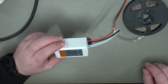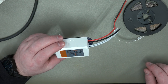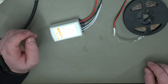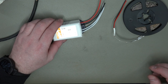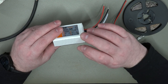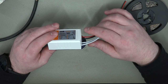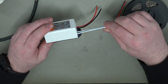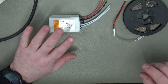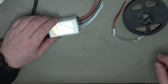We've got here our cheap little LED driver — this is an 18 watt rated one, 12 volts output, 1.5 amps, more than enough. I probably could have gone for something smaller, but it's difficult to find something that's really flat and can go behind the mirror. Since this is a rented property I can't make holes in the walls, but if you own your property you could put this in the wall behind and make it a completely hidden installation.